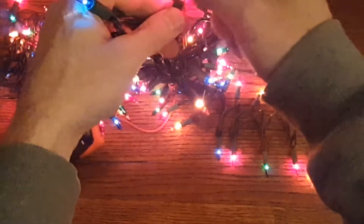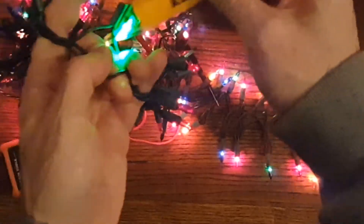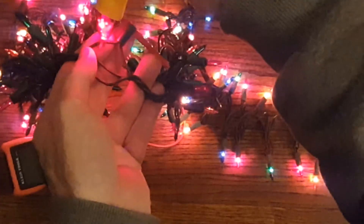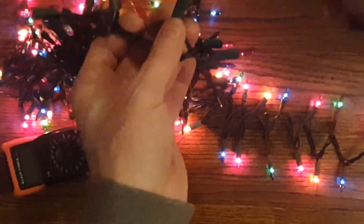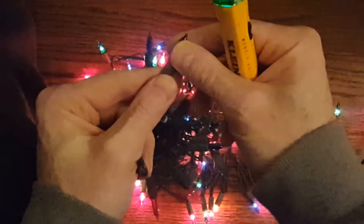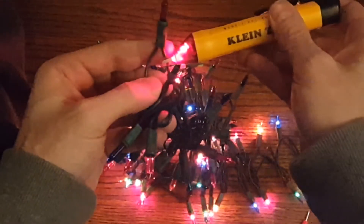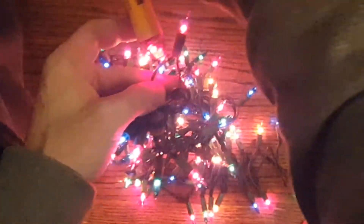In the case of Christmas lights, you should be able to see if voltage is going to that wire. As you can see, there's hot electricity coming up to here but then it stops — so it doesn't go on this wire but it is coming to here. If this was a bad bulb, same thing — you have power going to a bulb and then it stops. So then you press it in or replace it, and then you have power going to both sides.